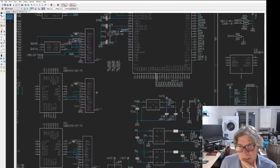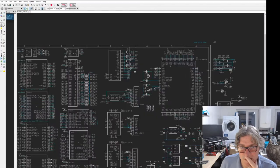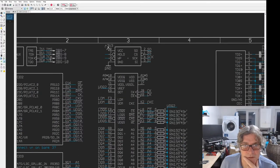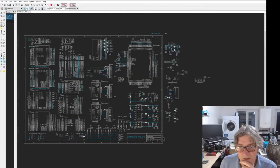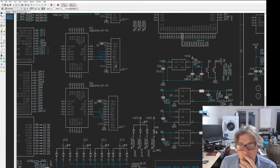I've already included a debug connector, which will go on the board, which I might not actually place, but you could add that in. I have the footprint for it there, possibly. I don't know how important it is to have the JTAG on the ECP5, but I will make it accessible for those that want to use it. But cramming it down the USB is probably not such a good idea, because we'd have to do something slightly non-standard, which I'm not keen to do.